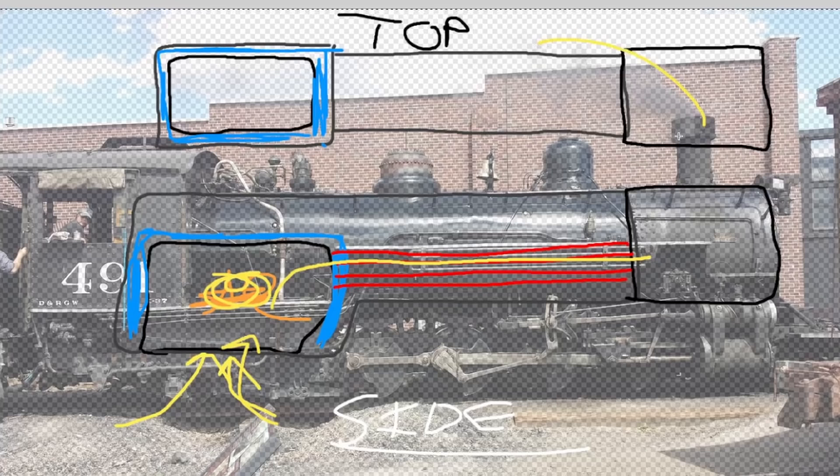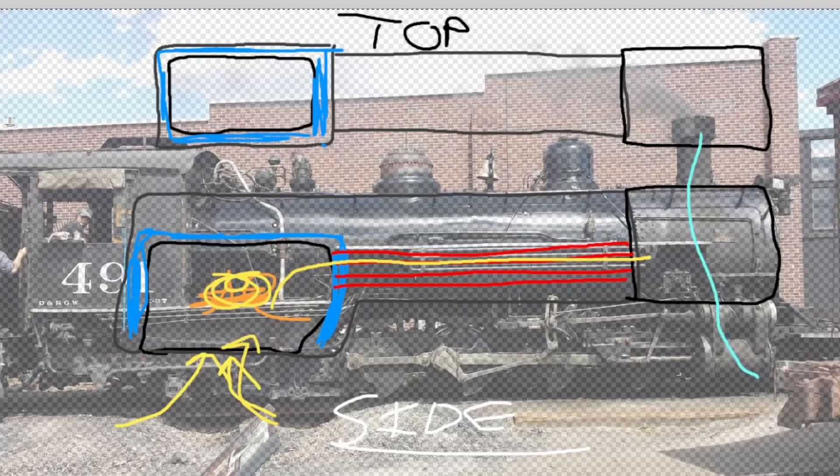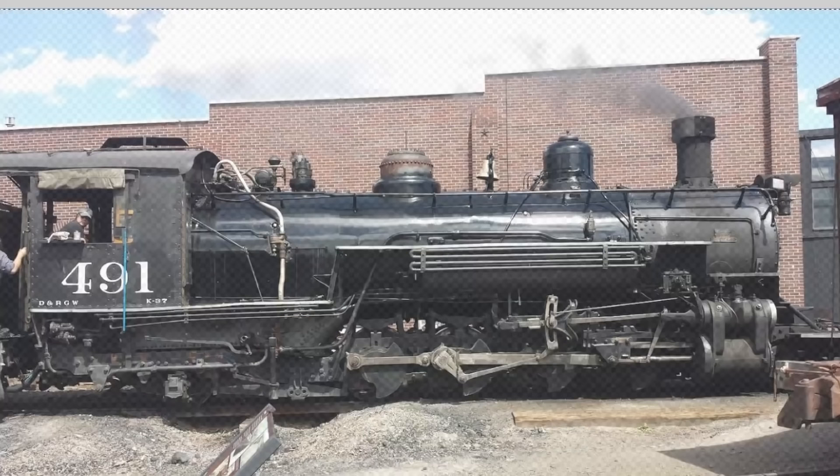The steam that drives the piston, when it finishes pushing the piston, comes into the smokebox and exhausts through a little nozzle called the blast nozzle, sending its exhaust out the stack. So your stack is a mixture of your steam from the cylinder and the fire exhaust. That is why sometimes you will see white coming out the stack, sometimes black — it all depends on what the fire is doing and what the engine is doing and the temperature outside.